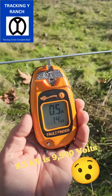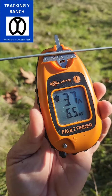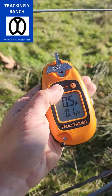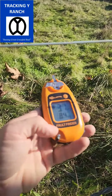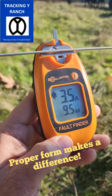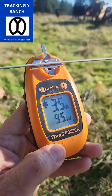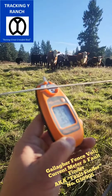So we're going to take our finger off of that, grab hold outside of the tester, and test our fence. It's not grounding that well through our body right now — we're at 6.5. We hold it like we would normally hold a fence tester and now we're up to 8.4. If we want to do even better, we can stick our thumb on it and now we're up to 9.4. There's a reason for these grounding lugs and a reason why to hold these fault finders properly — that way you get a more accurate reading and really know what your fence is reading. We got some happy cows out there today, so hope you guys enjoyed this.